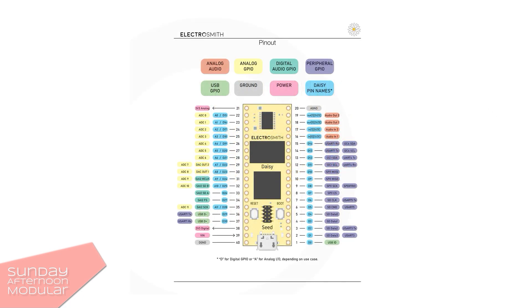There are 31 GPIOs, which means general purpose input and output. There are also 12 ADC inputs at 16-bit — those are analog to digital converters — and 12-bit digital to analog converters.